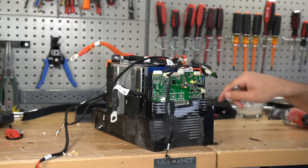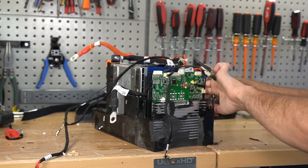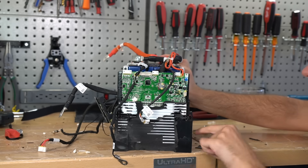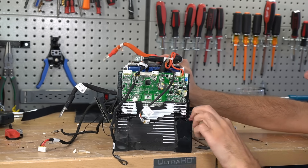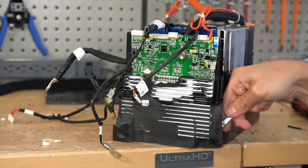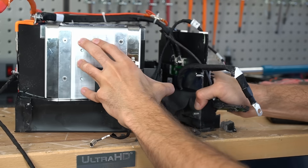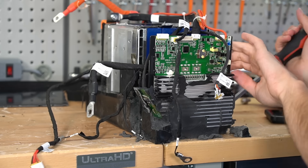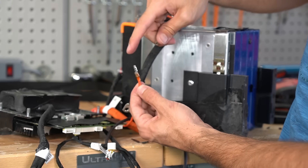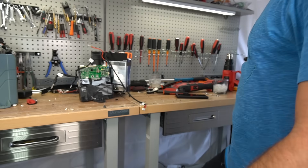This even has conformal coating — on a budget battery that is very impressive. Usually at this price point you don't get this quality at all. I cannot remove the BMS easily — they've really glued this thing together. There is so much glue in here; this is not user serviceable. I also noticed a wire that powers the BMS — similar to a server rack battery — which could potentially be used to put an on/off switch on top.